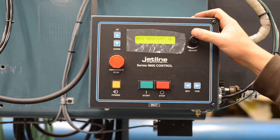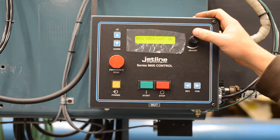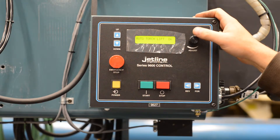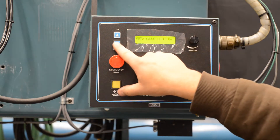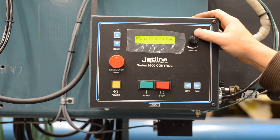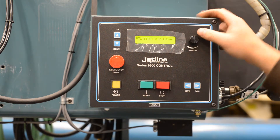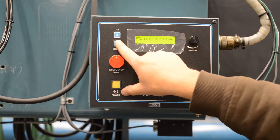Auto torch lift is selected on. That is the pneumatic torch lift that drops the torch into place at the beginning and retracts it at the end of a weld — otherwise you would have to set it manually via the first menu screen. PTL stands for pneumatic torch lift. The PTL start delay is not a delay for the time it takes to drop the torch, but rather how much time you allow the torch to drop before starting the sequence. We have it set for one second.